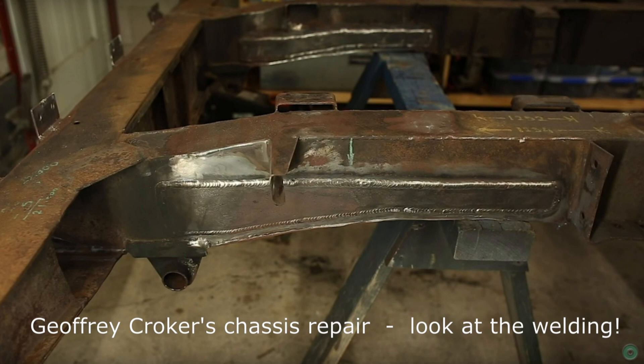There's a well-respected YouTube channel by a New Zealand publisher. The guy was grafting a new rear end onto a series Land Rover — he aligned it very carefully, but he did have heavy reinforcement, which meant large unbalanced welds, and by the time he finished welding it had pulled the chassis out of alignment by more than 15 millimeters. As a final footnote: I spent my working life in the oil industry designing and building offshore platforms, mainly on fixed-price contracts, and if we had oversized welds that was your profit up in smoke. So use the correct weld size, make the weld soundly, and you'll be absolutely fine.